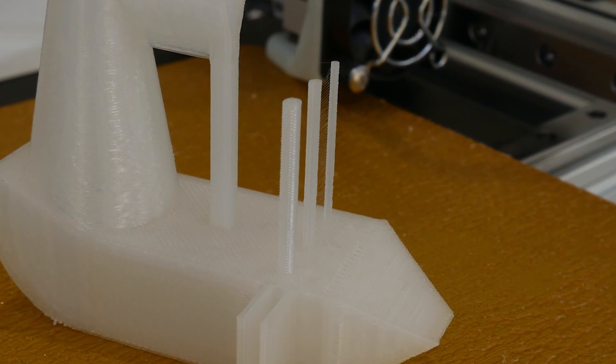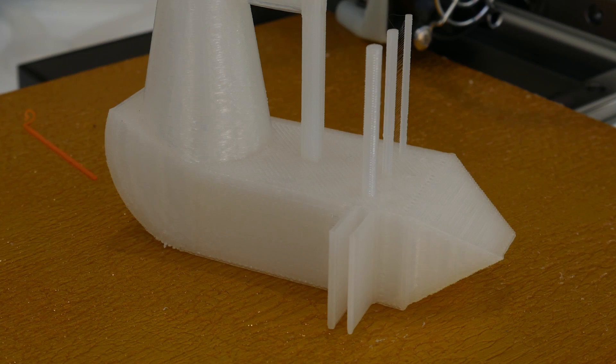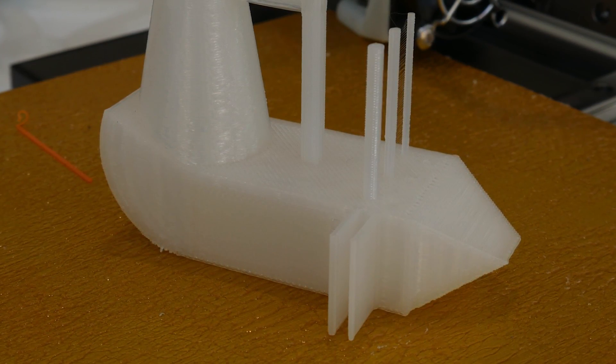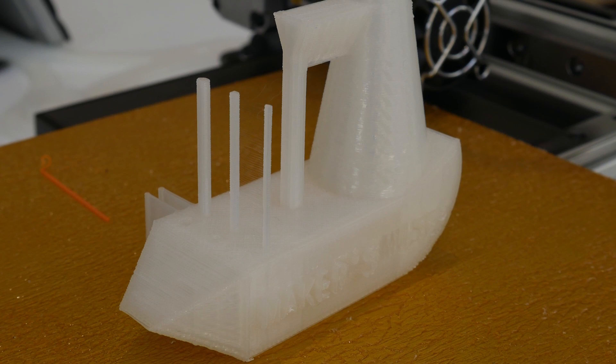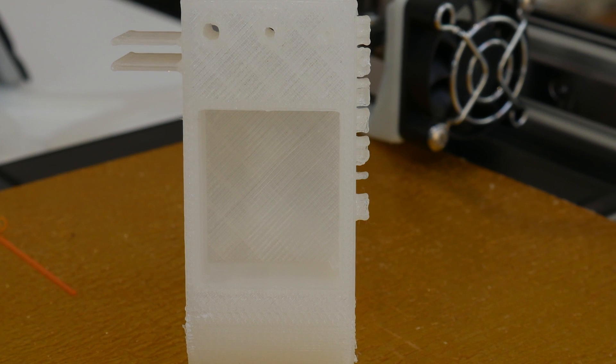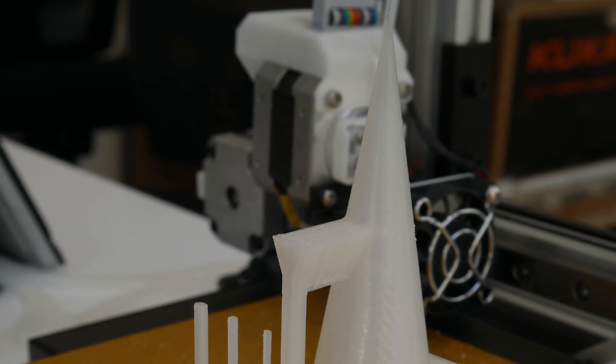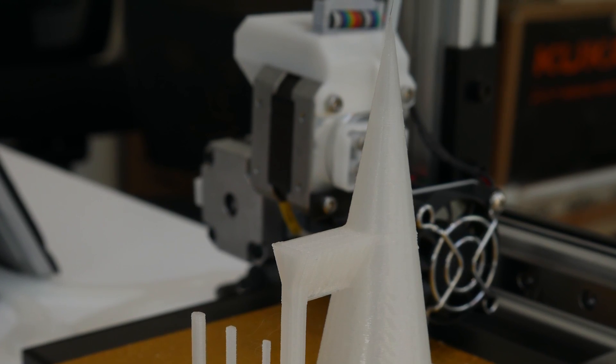The columns haven't been broken yet, and the little side fins — the smallest one at 0.4mm — did not print and was ignored in software, but the rest is great. The point with the 45-degree angle is sharp, the underside is sharp, and the peak is actually pretty good too — much better than many other machines when printing PLA. This machine has fantastic cooling when it comes to small details.